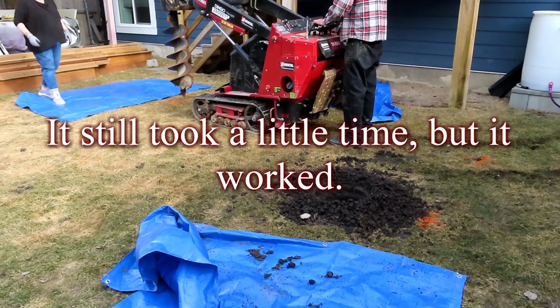Screw the rail hangers onto the top and bottom wood rails. Decide how high you want the top rail, and screw on the bottom rail so that the top rail will end up at the correct height. Our top rail is 42 inches, or 106 centimeters, high to meet our building code for a second-story deck.